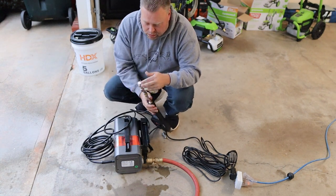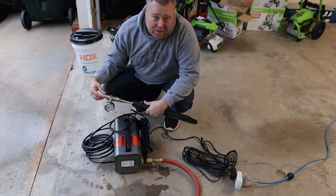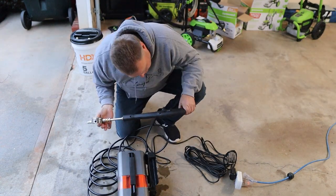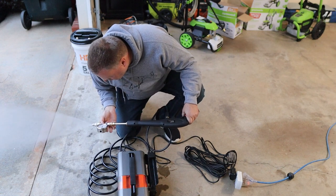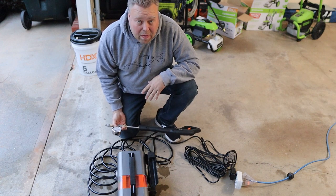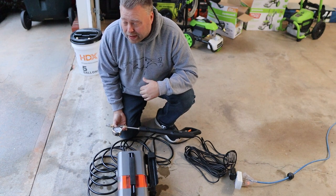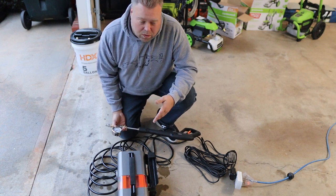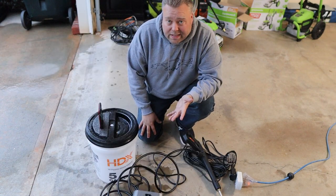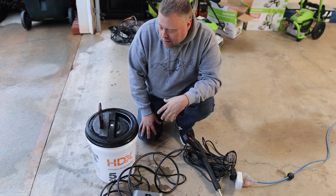Here's a 3.0 nozzle I would normally use — about 750 PSI. This is the 1.0 nozzle, which gives us the most PSI of the nozzles I have. We are getting 1550 PSI, maybe a little more, but we pushed 13.1–13.2 amps to get that — above the motor's rated 1400 watts. Obviously, the stock nozzle was getting around 950–1000 PSI, which is about what we want for car washing.